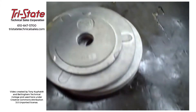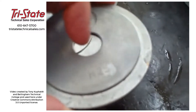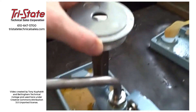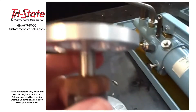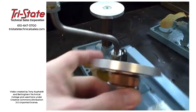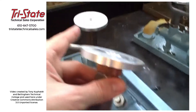The alternative piston screws into the same hole and we stack the same weights on top. Looking at the weights themselves, they say L5 H25. So this weight is worth 25 PSI when placed onto the high-range piston, but only worth 5 PSI when placed on the low-range piston. The only difference is the size of the piston — on the inside, this is a much larger piston, with five times the surface area, which means a given weight will give you five times less pressure than it will on the smaller piston.